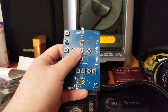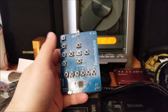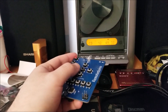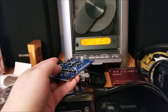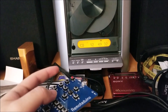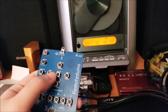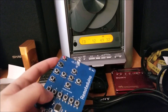To find the codes, I Googled 'Sony SIRC CD remote code protocol.' There are a number of pages, and between different Sony systems there's sort of a standard, but I found conflicting information. I tried different values for volume and power and wasn't able to find ones that worked. I'm going to have to do more experimentation. I don't have the original controller, and I don't really want to spend $10 or $15 to buy it just to find the codes.